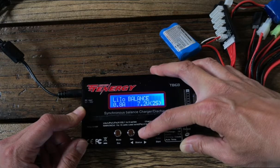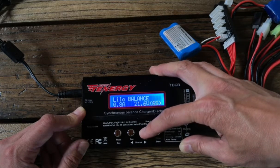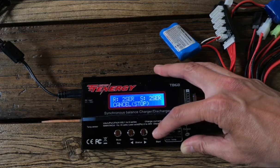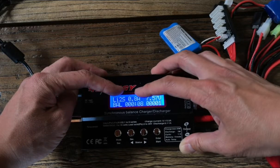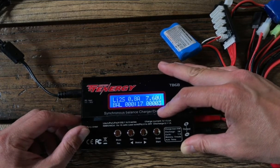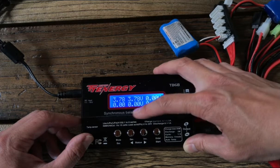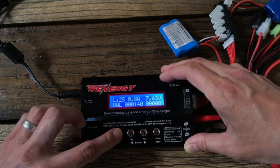We're going to toggle through just so you see the other choices. If you have a three cell battery it'll be 10.8 volts; a 4S lithium ion battery will be 14.4 volts, and so on up to 6S. We're going back because this is only a two cell battery. Press Enter until nothing's blinking, then hold this down for a couple seconds — it's going to check the battery. Press Enter one more time and you'll see a summary: lithium ion, 2S, charging at 0.8 amps. You can press Enter to see per-cell voltage; first cell is 3.78 volts, the second is 3.79 volts.